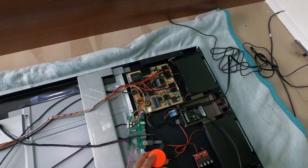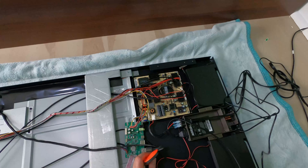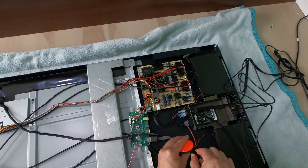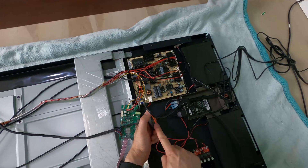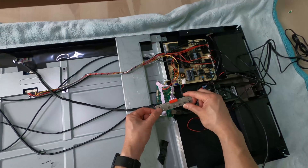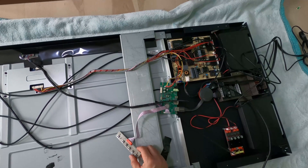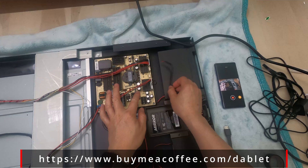Before cutting the loop, I just want to verify that the board is working — the backlight is working and the video signal is working — so I'm going to hook up this Chromecast. The Chromecast uses a 5-volt micro USB cable, so go ahead and plug that into the wall. Now plug the mirror's cable into the wall as well. Since we haven't cut the loop yet, we'll use the on/off button on the extension motherboard — press it to turn the TV on. If everything is working fine, you should see the Chromecast output. Excellent — let's proceed.